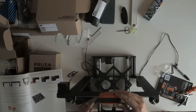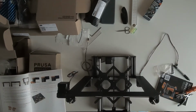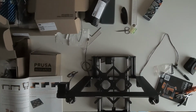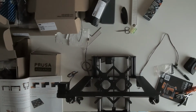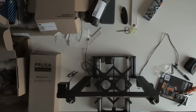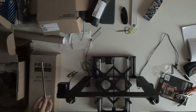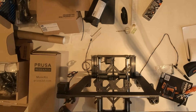The way I did that is I used a digital level, because my desk was not level. So I first determined the levelness of the frame, and then put the digital level onto the X assembly. If they show the same numbers, that means they're level. They're parallel to each other. It was getting dark, so I switched on the lights.